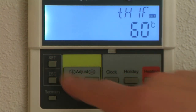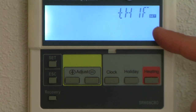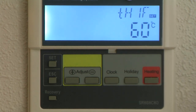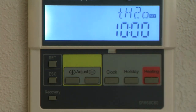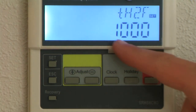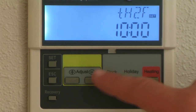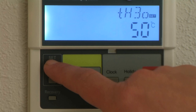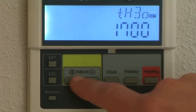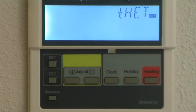Press the set button twice and we're heating it up to 60 degrees. So if you're below 50 degrees at T3 the element will come on and heat all the way up to 60 degrees up until 6 o'clock in the morning. Timing heating two on is set at 10 o'clock, with timing heating two finish also at 10 o'clock — this means it doesn't actually come on. In the third time frame, timing heating three on is at 5 o'clock at night until 11 o'clock at night, heating to 50 degrees — this will take care of your night time showers.